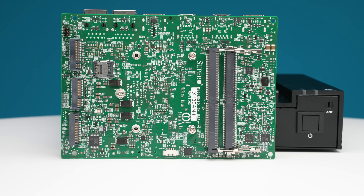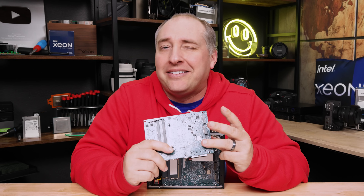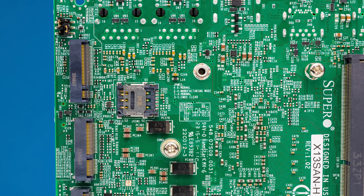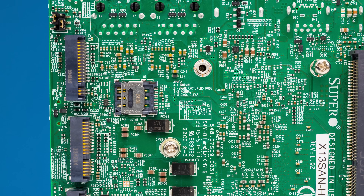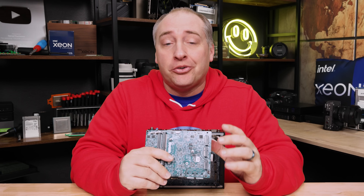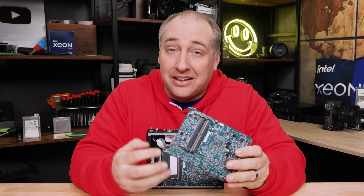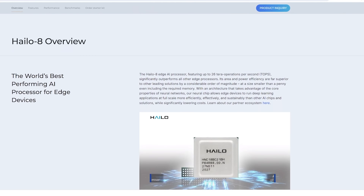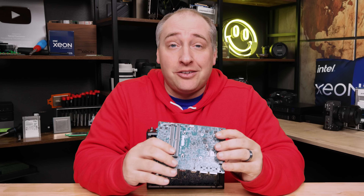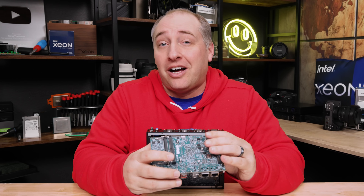The B-key slot is a little different - you get three different connections to it: USB 2, USB 3, and a SATA connection. There's also a little nano SIM slot, so if you want a 5G modem, you can do that here, plus there's a PCIe 3 x1 lane. One of the other reasons for so many slots is that this system is designed to handle AI accelerators, like the Hailo-8, which is a 26 TOPS AI accelerator running at around 2.5 watts - great for embedded AI acceleration in this little form factor.